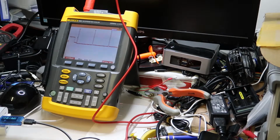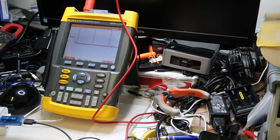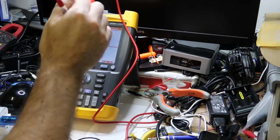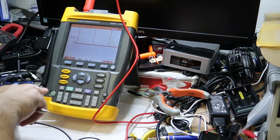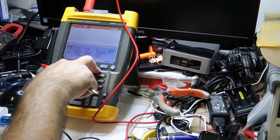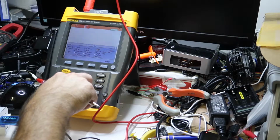Okay, so we are wrong because the distance between the pulses is about 80 milliseconds. And let's say if 1 square is 20 milliseconds, so we will have 1, 2, 3, 4, 5, 6. By the way, we can measure it, of course. Let's do a measurement. So we will put scope reading and we will do a pulse. We will read the pulse. Here we have a pulse.